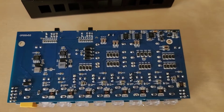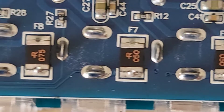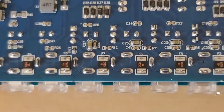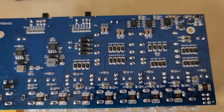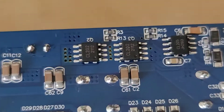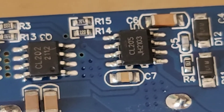Inside you can see a lot more circuit design. There are load series resistors for the case of a short circuit — if you short it out, all that power goes to these resistors without destroying the rest of the circuit. You can see all the capacitors, some diodes to rectify, some inductors here to get rid of all the noise, and up here is the switching circuitry that converts the incoming DC over to AC to run through the isolation transformer.